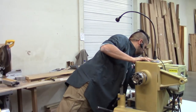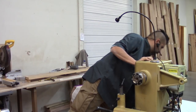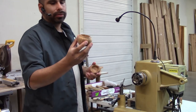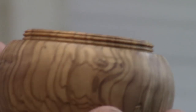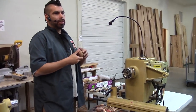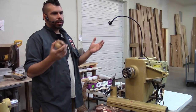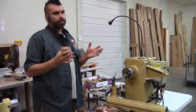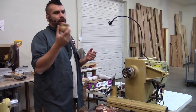Other local woods in here, the other one I found that threads well is olive wood. It doesn't thread super well, but you can get a decent thread on it. Again, the wood has to be completely bone dry. Just with the friction-fit threaded boxes, the wood will move, and when it moves on threads, it might not open again.